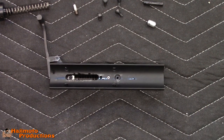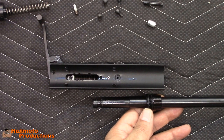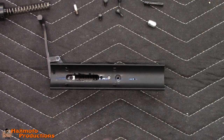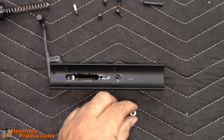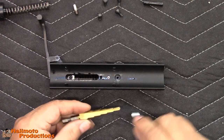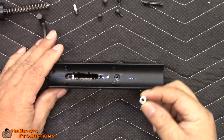That's pretty small. When we look at the barrel opening, that's equally as small. But what we can do while we're in there is get a better transfer of air through this air rifle if we increase the size of that transfer opening to match the size of this opening. This is fairly large here. If you were to measure what that transfer opening is, you'd be somewhere around the 3/16ths area. So I'm going to get a drill bit here just to demonstrate — there's 3/16ths and you can see that fits on there very nicely. So if a 3/16ths were used through this opening to increase all the way through that breech block, we would have a nice open path.